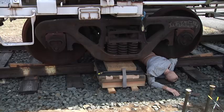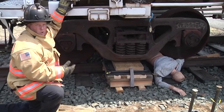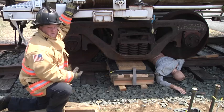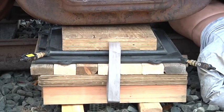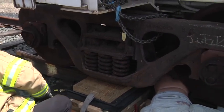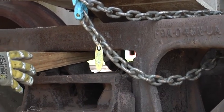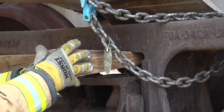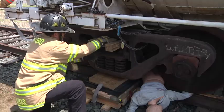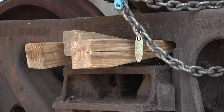Our lift stack has been constructed, built right up to the underside of the load, which is important with airbags. We don't want to try to fill a void using the airbags — we want to use our cribbing so we can maximize the lift potential of the bags. An additional thing we need to do before we lift the train is block out the train suspension. Mark's going to come in with some four-by-four wedges and just take up the space above the suspension system, so when we lift, the suspension doesn't compress, requiring us to lift higher with the bags. The wedges are set in nice and snug — the suspension has been disabled.